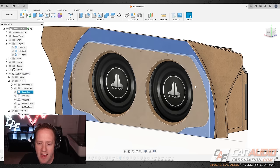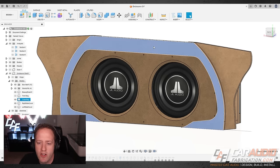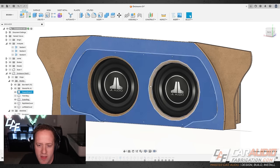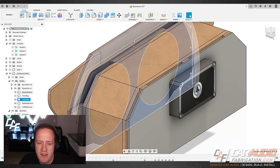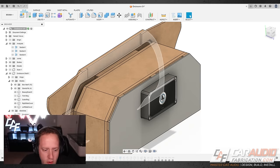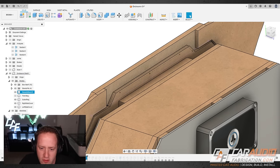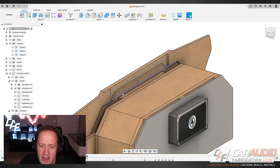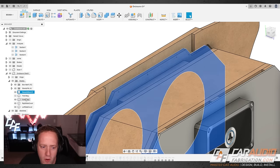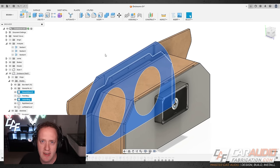In order to hold this piece on, I want to make it one piece with the beauty board — these two pieces will be an assembly that bolts in together. To bolt it in from the back side, I started adding the 'hole flange sketch.' It's just a little flange that allows me to add some holes. This beauty board and outer ring will be mounted as a sub-assembly which then bolts in with everything together, so I added that tab ear for additional mounting.